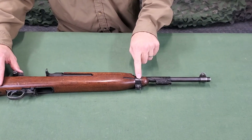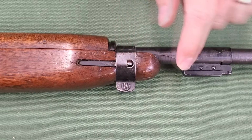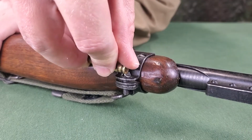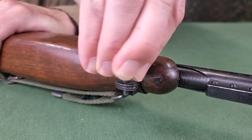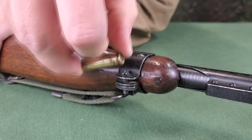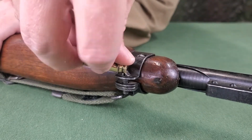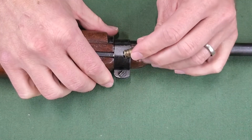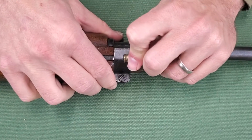Place the carbine on a level surface, resting the muzzle so that the head of the upper band screw is up and to the left. Using the rim of a carbine cartridge, loosen the upper band screw about 1/8 of an inch. Depress the upper band retaining spring with the base of the cartridge and slide the upper band over the retaining spring and off the stock.